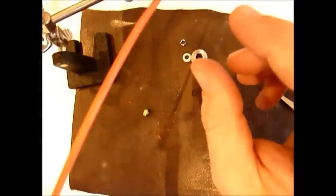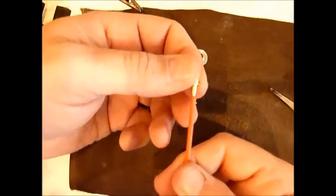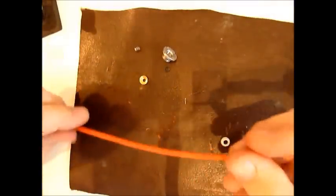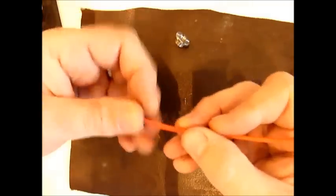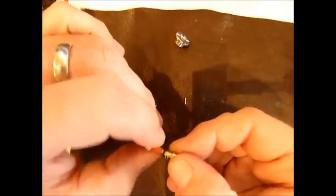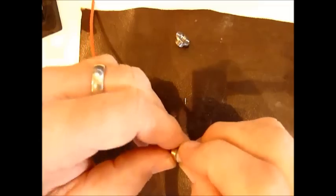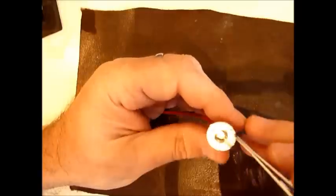Some of the tri-rated wire we've got is too thick, but this is silicon insulation so it's thinner and perfect for this — so that's how it's done. That's nice, neat, solid and on there. Then you put it all back on in reverse order: put your spring on, your o-ring and your brass cap, slide those up. Put your plastic insulator on, screw that back together, and then screw it back into the threaded bit — and there you go, you've got it done, simple as that.